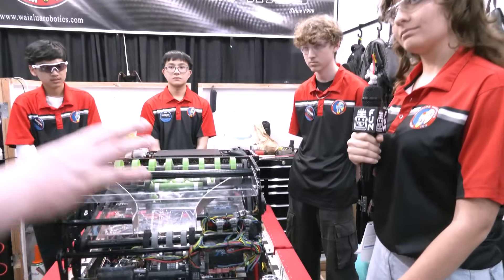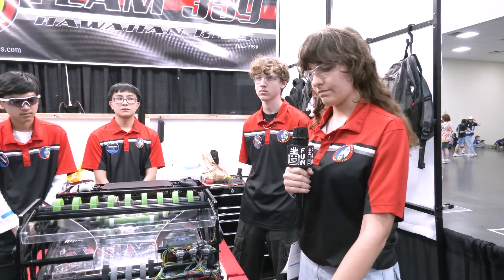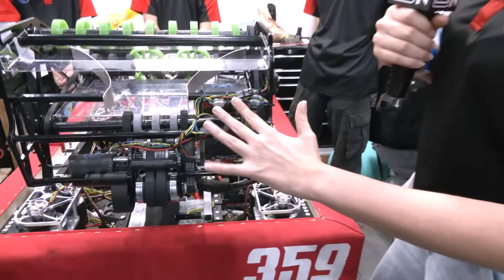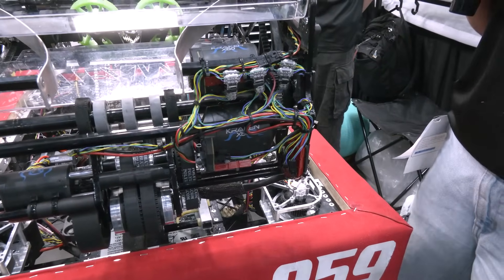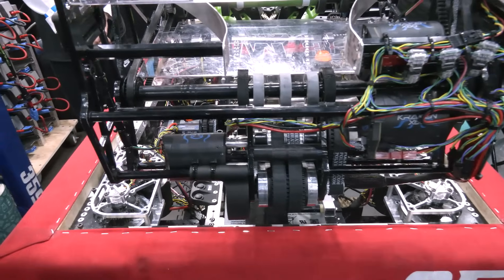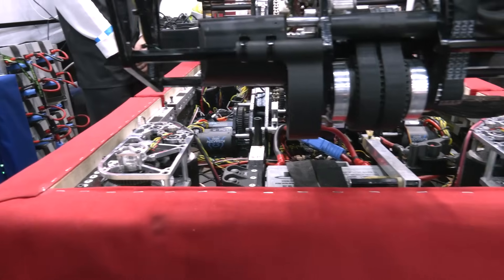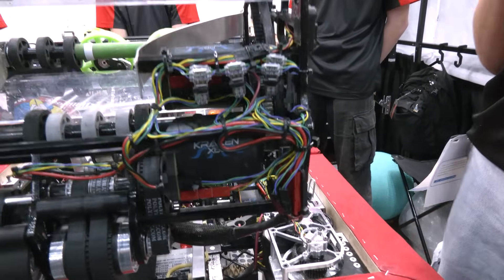That just helps us stay match ready and ensures that even if something's wrong and we can't catch it, we're still able to run and go to our next match without problems. For a team that hasn't done this before — if you use star topology originally, it's not very hard because you pretty much just double it up and connect it at the bottom. If you use daisy chaining as your main CAN line, it might be a little bit harder to switch over. But it's definitely something I would recommend — we've had it for over four years and we've never had a failure.